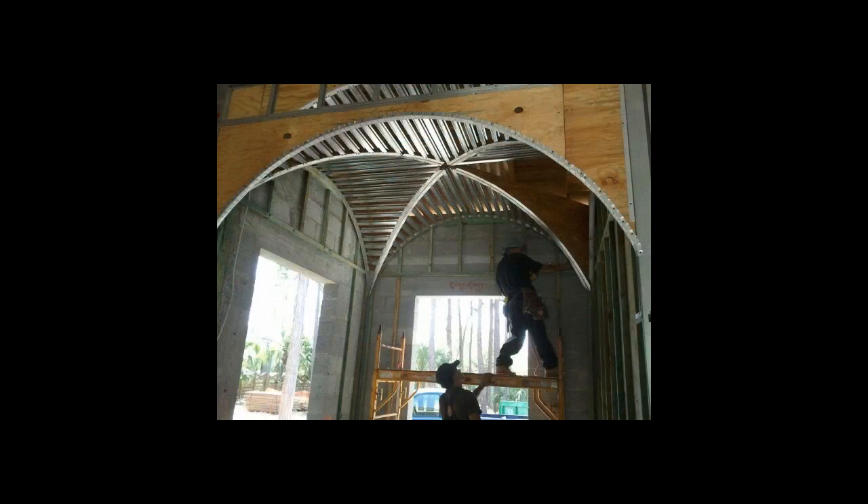Make sure you leave an opening where the arcs intersect so that you can provide some lighting. After you do that, start connecting the outside arches with the intersecting arches with aluminum hi-hats. Make sure you don't space them any more than eight inches. Once you start screwing in the drywall, you're going to want to have enough screws to bend the drywall properly to create a perfect arch.